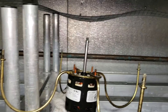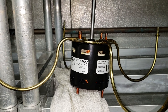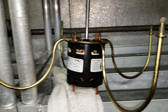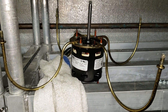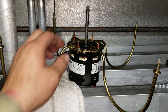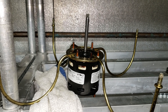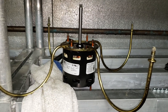They also make universal ECM watt motors. Those things are great because you can go between 208 or 115 volts. I was turned on to those by Joshua Monk — he told me about them for supermarket use. They've saved my ass a few times being that they're 115 or 208, but they only have two wires coming off them, so you don't have to do any magic. They're ECM, the size of a watt motor — I think they'll replace a 6-watt all the way to a 25-watt, but they're the size of a 9-watt. You can fit them even into a little reach-in cooler. Really nice motors.